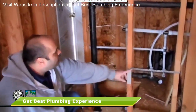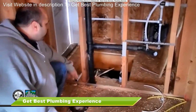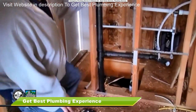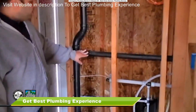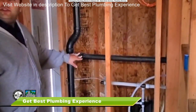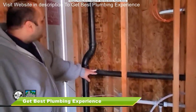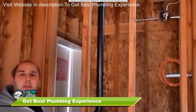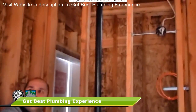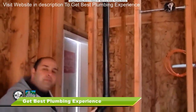We've got our hot and colds coming across. We've got our cold line for our water closet. As we come up, you see we pick up this vent here from the washing machine drain that we just looked at. It ties into here, and then this 2-inch carries up, and then it goes out through the roof. So we'll see what else ties into that as we move up through the floors.